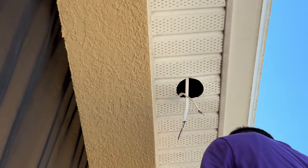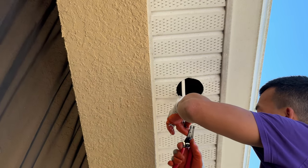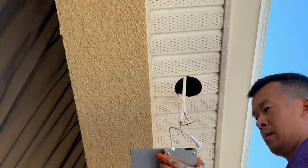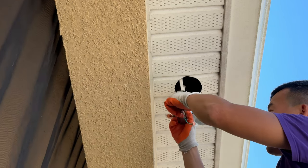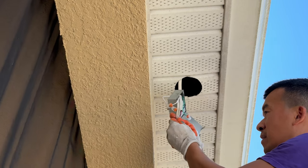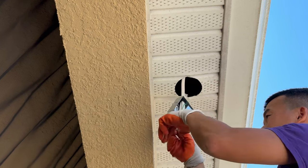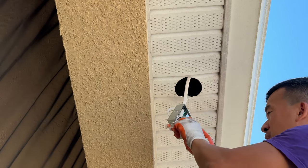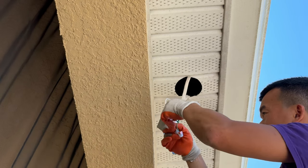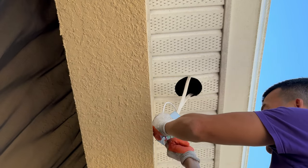We'll go ahead and wire this one up right here to show you the detail of wiring. Pretty basic - just strip it back, three wires that we need on each side. Get the driver prepped up and slide both of them into the same position to get some more room to work. First thing on the connect is the reds because the red just continues on from my floodlight - stick a red into the quick connect, make sure it pushes all the way in and you can see it through the clear housing. Once that's done I usually twist these just to make sure it gets a good connection. Then I'll go ground next which is green to the bare wire.